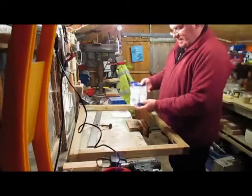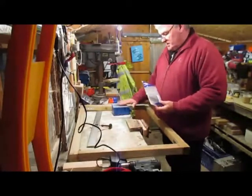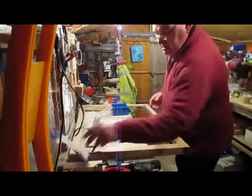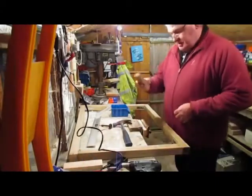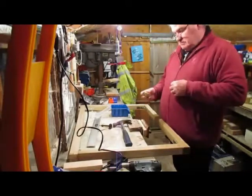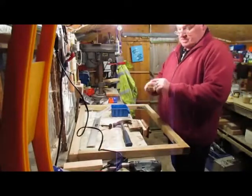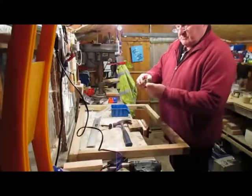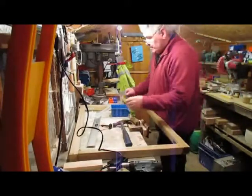Okay, so this is the pack of the nails we bought when we bought the brackets, etc., and just for convenience, I've popped them into a box. And so now I'm going to start doing my nail up. So I've got a nail gauge. There is another video on my channel that shows you how I made this, and all this is to make sure that we're going to get them, this doesn't really make them upright, but it makes sure that we get them exactly the same depth. Okay, so it doesn't really matter where I start now.